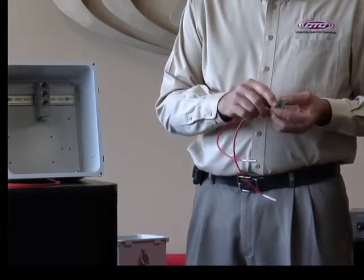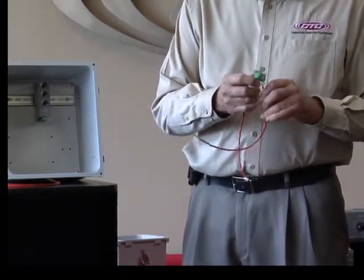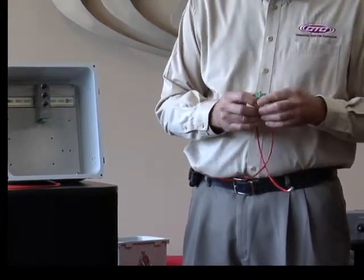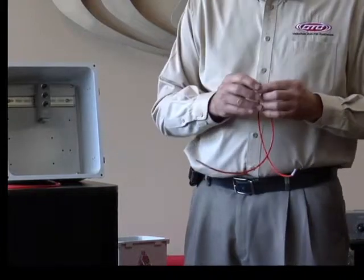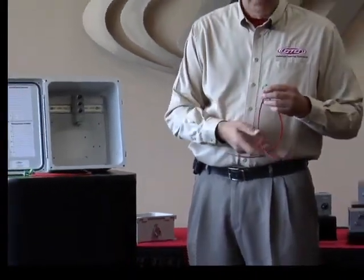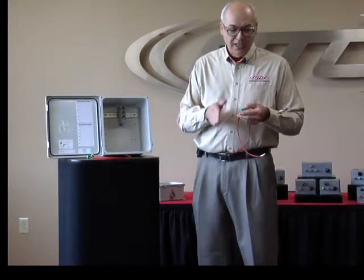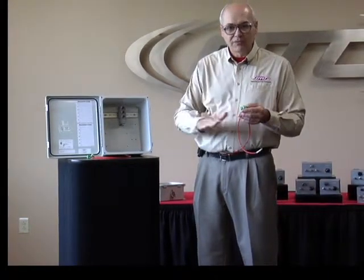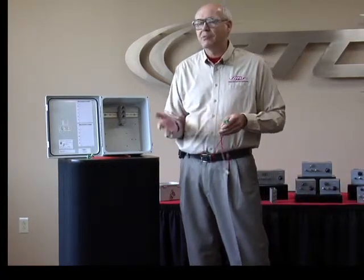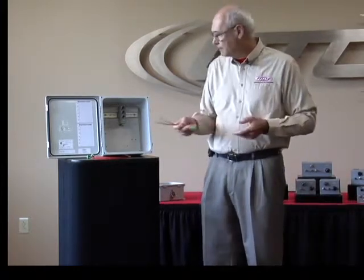This is also a screw type connection, but you can see that it involves two cables. One of these cables would be your sensor input, and it could go to your switch box or your BNC connections for your normal outputs. The other one would run to your online data collection. So in this manner, you could simply flow into your switch box and flow back out to your online data collection. So we wouldn't have any dead ends there. We wouldn't have anything we have to buy again. We can just continue to improve our program.